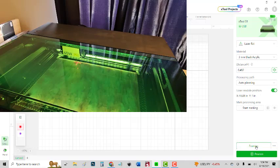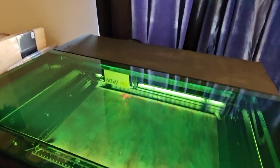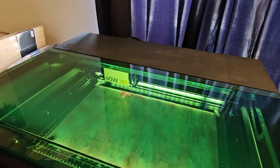It tells me where the position is, and then the framing. I have it set up right now so that the X is in the upper left-hand corner. You can put it in the middle, the upper right, wherever you want. When I click on framing, it beeps, the screen comes up, and the button turns blue. I hit that button and you'll see what it does — it draws a box around where that job is going to go. That tells me exactly where it's going to go. If I'm doing a coaster or a cutting board, I draw the shape of that coaster or cutting board, and when it goes around it should be aligned perfectly with the edges.